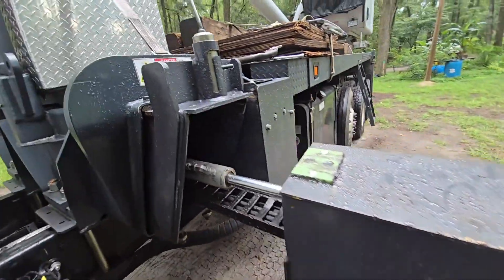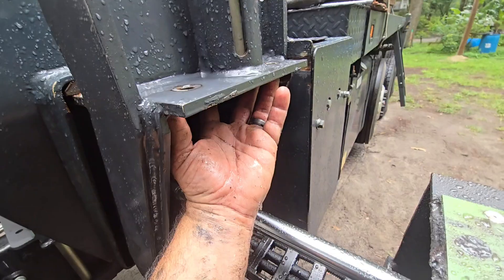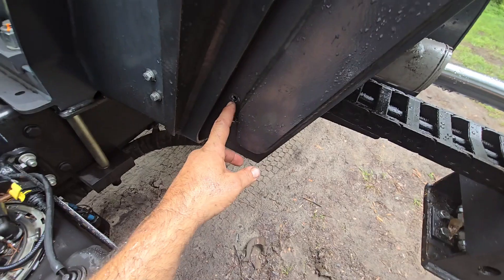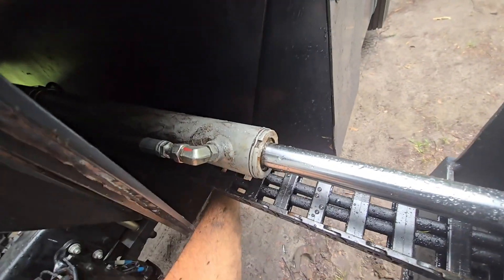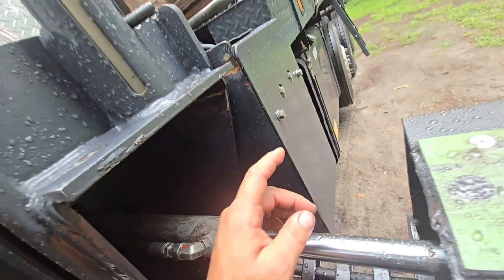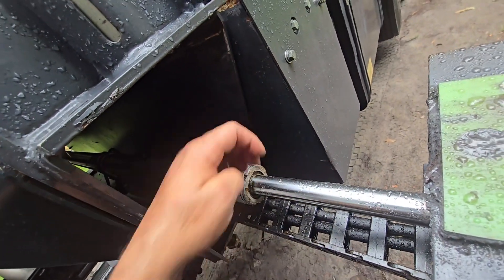To prevent this from sliding out, there are brakes or wear plates. One goes bolted under here and there's five bolts — those five need to come out. There's also two bolts on the side wear plates. And there's a wear plate on this side which we did not even have to remove, but if you wanted to remove that wear plate, you would actually access it from this panel and you can get to the bolts on that side.